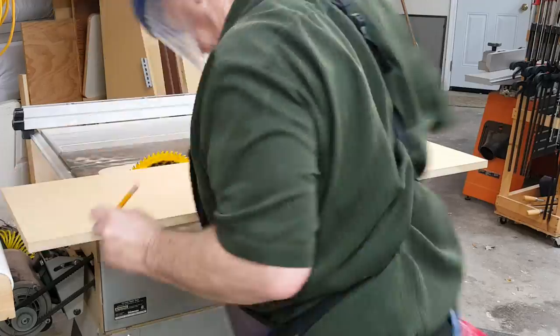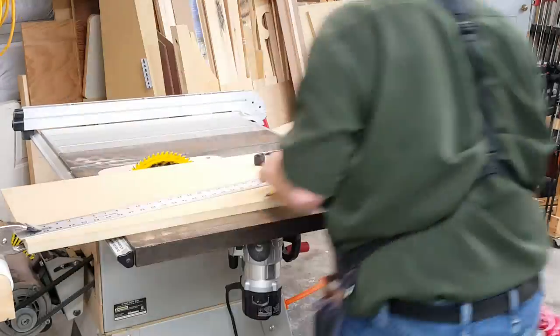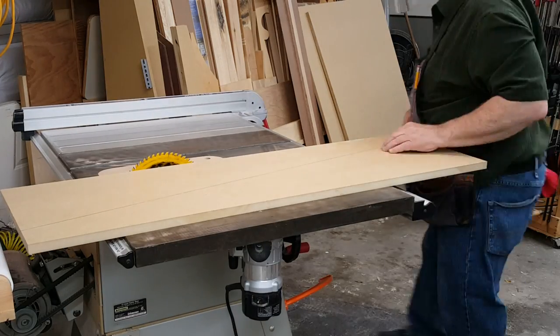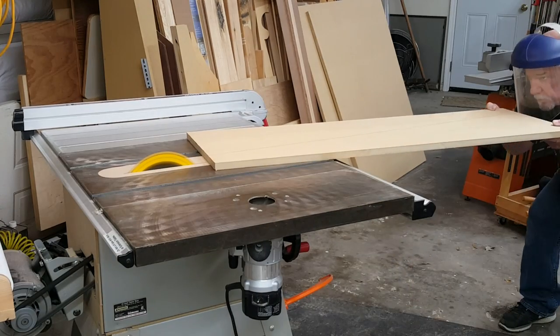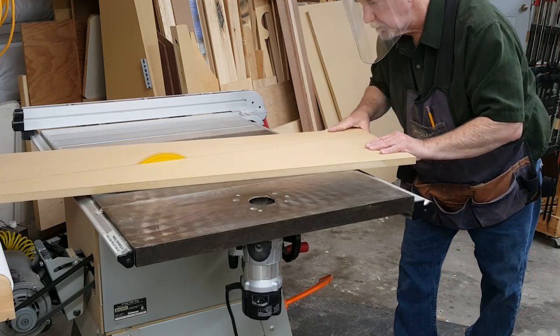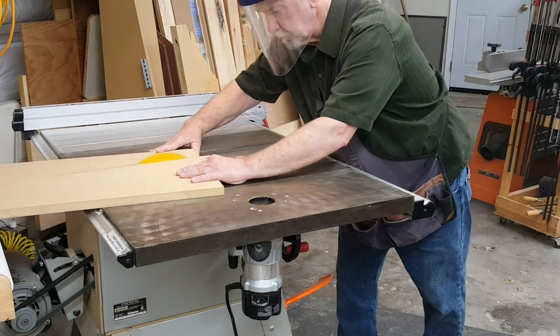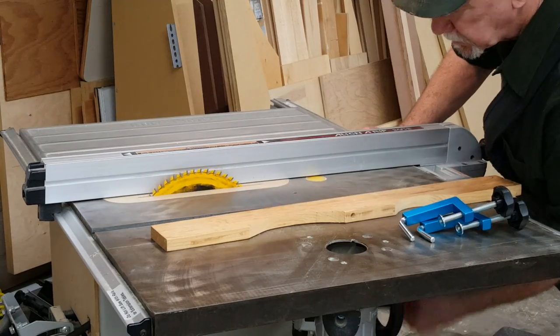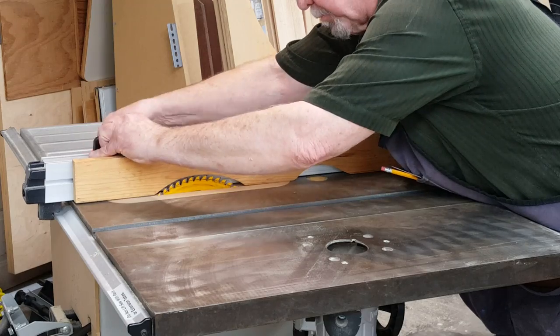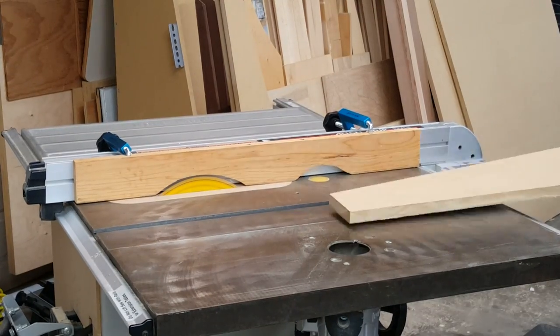So if your project is designed with 4 by 8 in mind, you have to do some accommodating. The 4 slanted braces under the platform measure 3 inches at the top and 11 at the bottom. So I cut two pieces that were 14 inches wide and marked a diagonal line from 3 inches at the top to 11 at the bottom. Cutting on that line gave me two pieces with the same taper, and then I did a little evening up with the table saw.